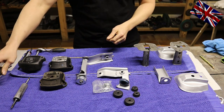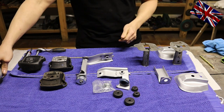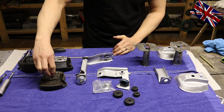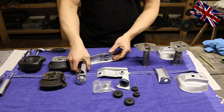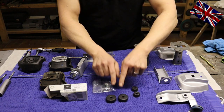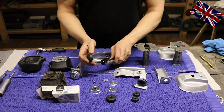The rubber mounts: the engine block has been sitting on these for 35 years or more — no surprise they had to be changed. Talking about shock absorbers, there is a repair kit available — see the drop-down at the top right. This kit consists of two upper rubber dampeners, an assortment of drop-forged washers to hold and fit snugly, plus self-securing nuts. Note: this kit does not include the shocks — those have to be bought separately, available from different suppliers with a range of prices. Reuse the old brackets; they are good enough.